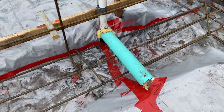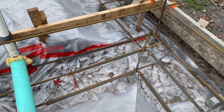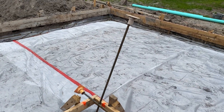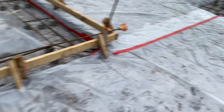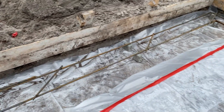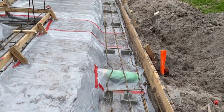They ran the rebar underneath this pipe for the outdoor sink. You'll notice here where we go from three bars to two — out here it's just light framing above and this is all porch, so not a lot of load on this end. In this little bump-out area it goes from two bars, and then back into three where the primary main roof system will sit. Out here is a conventionally framed, much lighter-weight roof system, so it only requires two bars of steel in the footing.